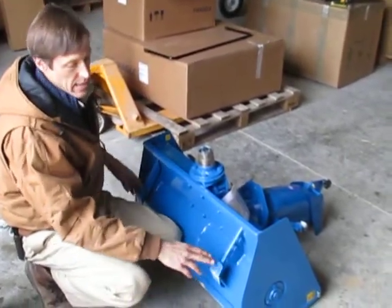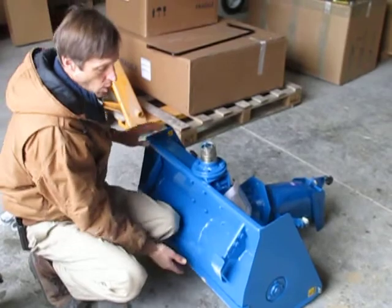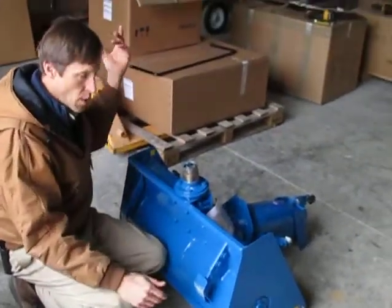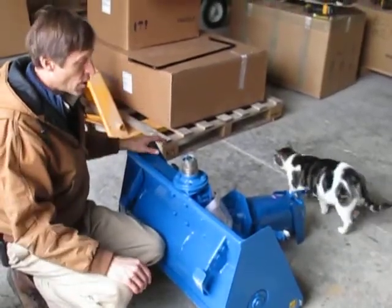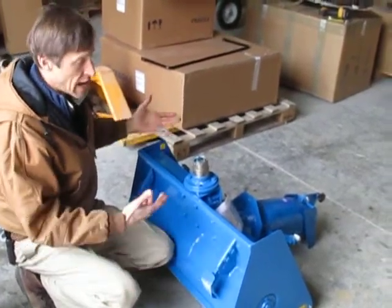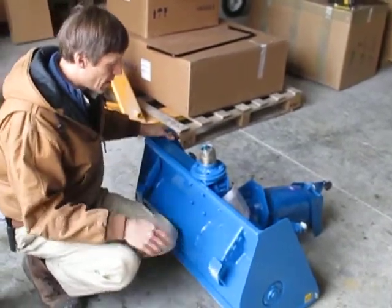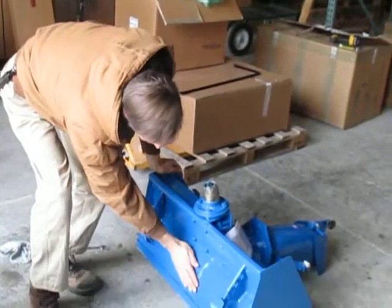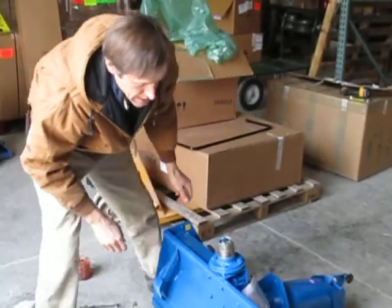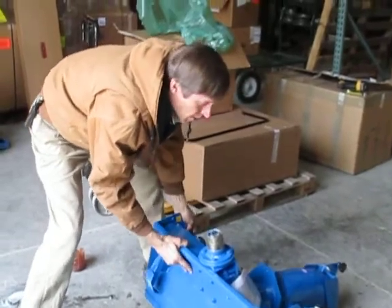The idea of the skids is this: if you're using this thing on a gravel driveway, you want to adjust the skids down to hold the mouth off the ground a little bit so you don't scoop up all your gravel and blow it out the blower. The more gravel you've got going through the thing, the more chance you can actually get a clog and shear a shear bolt. There's also an extra reinforcement plate welded on there. This is a very heavy steel housing — these things are built like a tank — and the actual scoop on the bottom is replaceable as well if you wear it out.